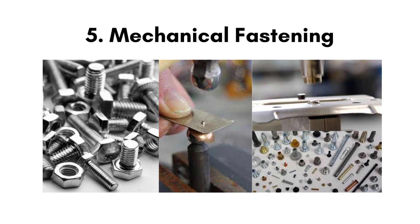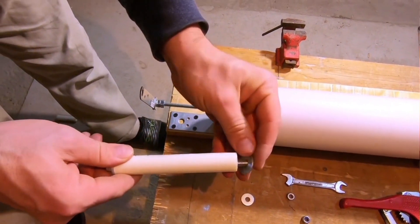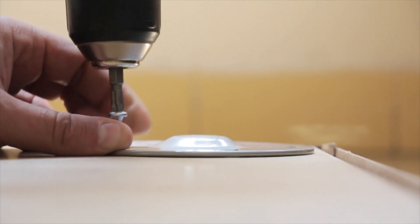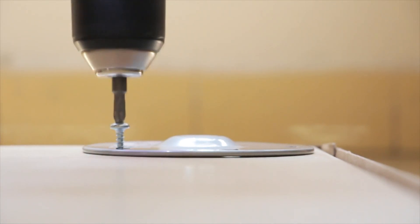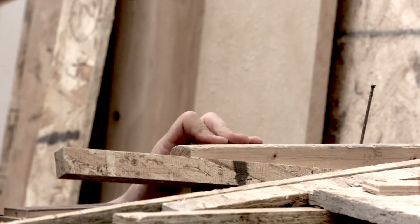Number 5: Mechanical Fastening. Mechanical fastening is the most common method of joining many materials within industry. Originally used for metal joining, it is also well established for joining plastics to themselves and to other materials. There are two main categories of industrial fasteners: permanent and non-permanent. Screws are examples of non-permanent fasteners, since they can be removed, replaced, and reused, though they increase product cost due to increased assembly time and are more difficult to handle and align. Permanent fasteners, such as snap fits, which are integrated into the parts through direct molding, are more robust and do not have the potential for working loose.